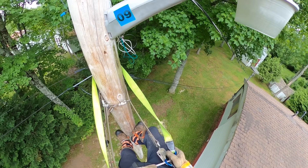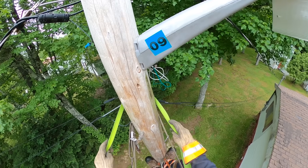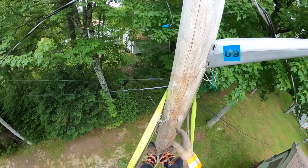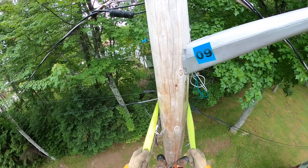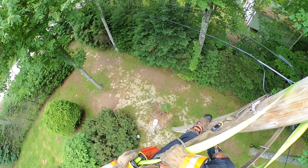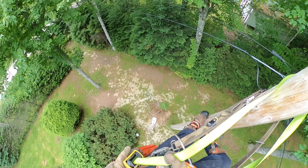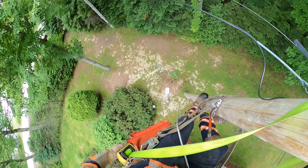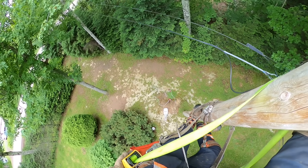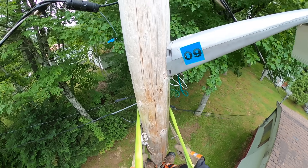That way we're double-belted and now we're ready to unhook our main belt. These retractable lanyards — you don't really want to set your weight down into them. It works like a seat belt: if you put your weight into a retractable belt and you shift your weight, it could release and drop you back until you run out of belt on the retractable device. As I pull into the pole and take my weight off, we get some extra coils around our loop. If you snap some weight into it, it is locked, but if you shift the wrong way it could release and drop you.